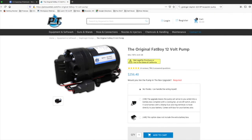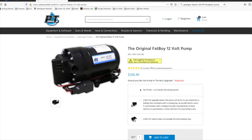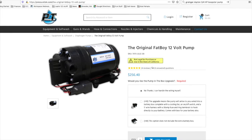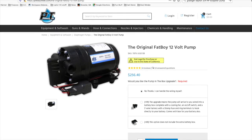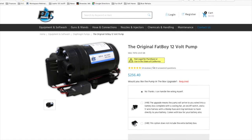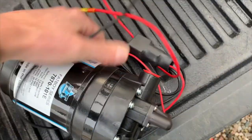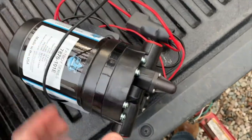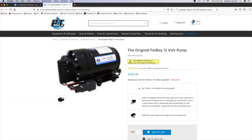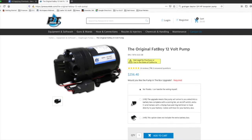The cons are that this obviously requires a big battery — I ended up with two truck batteries. I found that two batteries were necessary, and I could use it for a couple days of work and then I'd have to recharge overnight. This type of pump also requires some sort of chemical storage tank or bucket to draw from — if it's a tank, it can take up space and be quite heavy. This is an on-or-off pump; it can't be throttled. If I tried to throttle it, it would overheat. It would also overheat from starting and stopping too quickly, so it really just wants to be turned on and run for a couple minutes, then turned off for a few minutes, then run again. Overheating really reduces its lifespan.